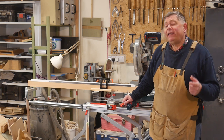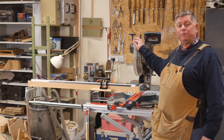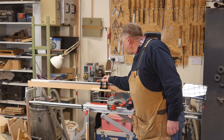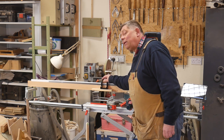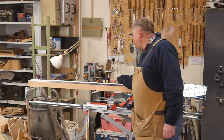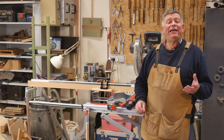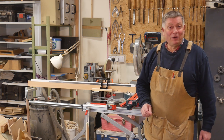Hello, I'm Steve Mascary and I have built an absolutely fantastic flip stop fence for my sliding compound mitre saw. I've got over a metre of capacity on this, and there's an extension which more than doubles that. The flip stop slides along the fence and I can set it with this cursor against the scale to any dimension I want. It flips out of the way so I can get a square end on a board, then drops back so I can use it as a stop. All my pieces will then be exactly the same size and exactly the dimension I intended. And it's all made from a 50-year-old bookcase and a 90-year-old interior door. Welcome to Workshop Essentials.